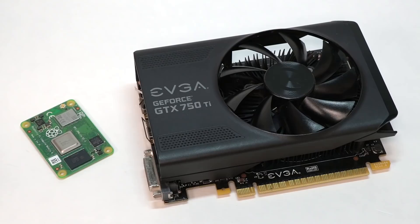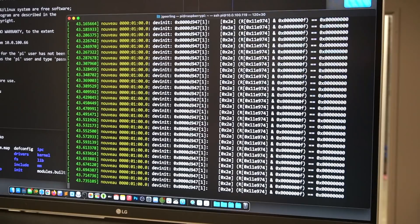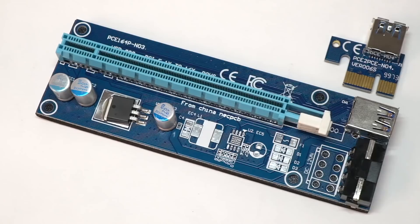I tried installing Nvidia's ARM driver like I did for the 710, but kept running into compilation issues. So then I tried cross-compiling the Nouveau driver, but it kept locking up on boot. I blacklisted the driver and tried enabling it manually while monitoring the dmesg output. That did show some output, but unfortunately the Pi would always lock up when the card tried initializing. Following many people's advice after that last video, I tried running the card in three different powered risers, instead of just plugging it into my Pi via an adapter.